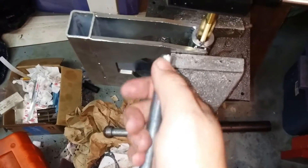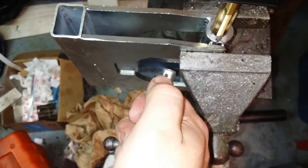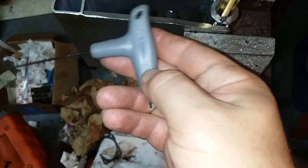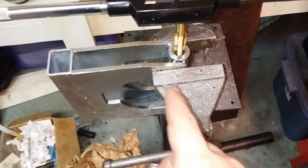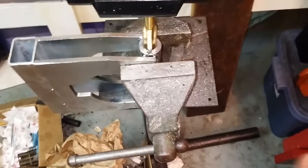One other fascinating fact. The nub that was on the end here actually is held in with a teeny tiny little Allen — 1.5 millimeter. I happen to have a T-handle for it, and it fits. Had I known that, I probably should have just used it and pulled the tip out. But instead I didn't — I retracted the whole thing back out and the tip broke. Whoops. If I had known that little Allen set screw was there and I just wasn't paying attention, I probably would have saved that tip. Doesn't matter, I can make a new one.